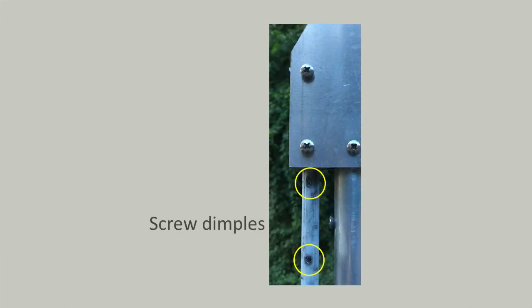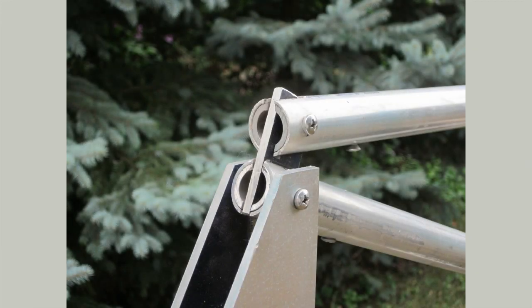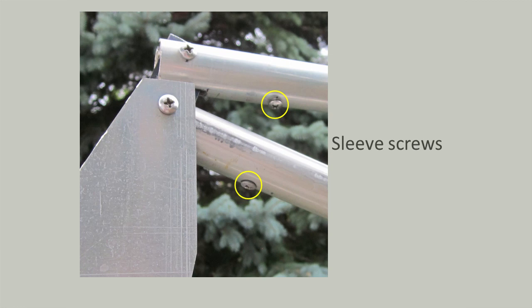I was concerned that a hole drilled all the way through such a small rod may weaken it too much. Here I show the rod pulled down out of the block. The two black marks on the rod are shallow dimples I drilled to receive the screw ends. In back of the upper unit is where the angled brace pole connects to the main mechanism. This location is best because it allows the most force to be transferred. If the brace is connected lower it causes the main mechanism to flex. Notice the inner sleeves — I was concerned that the forces at work would cause wear around the bolts, elongating the holes. These short sleeves distribute the load across more of the tube. These are just short screws, not bolts, that secure the inner sleeve to the outer tube and transfer the load.